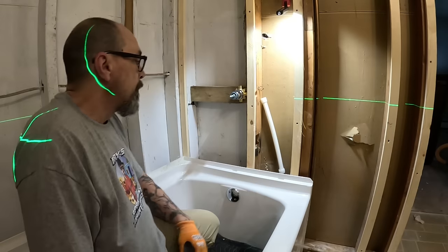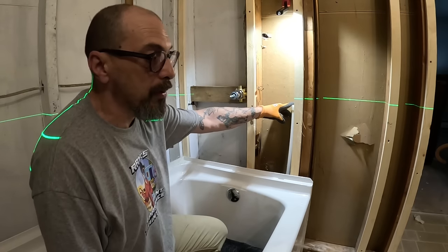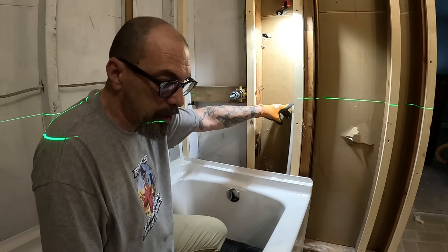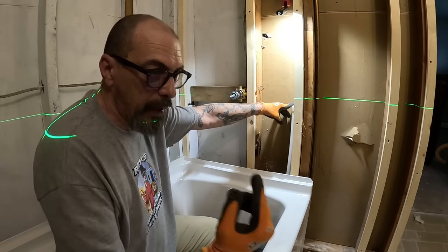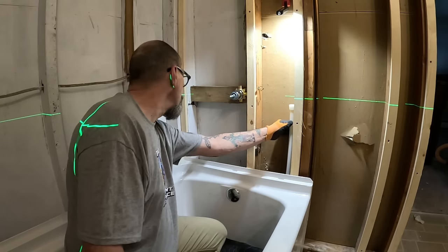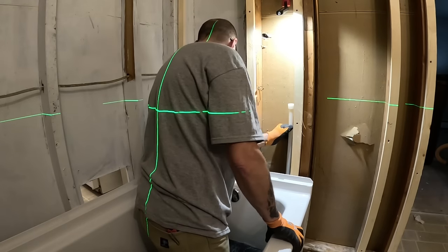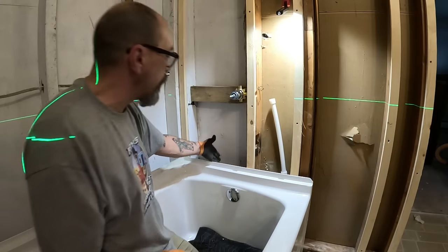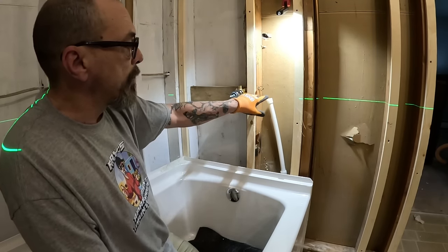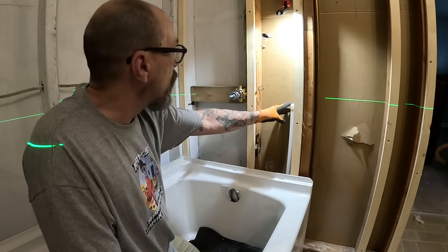Cool? So yeah, my water line, this is the main cold water. It'll go straight up and connect to the water heater, which I need a SharkBite for, because the fitting I have is wrong. So I need a 3/4 SharkBite. And what else? It's a T down there, T for the cold coming up. We come over here with a shorter piece of copper, then reduce down and make the connection. Cool beans.